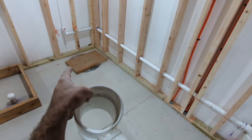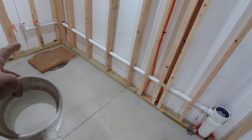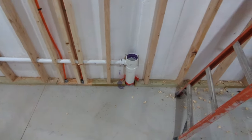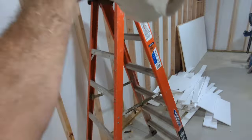This is already at 20 inches from the floor, which is sort of the top end of that height. Any higher and you start to have a really hard time connecting the drain underneath the basins in the sink, and then the sink needs to be lifted, and it just doesn't meet code any higher than about 20 inches off the floor for the rough in plumbing. So it forced our hand, and there wasn't room for the clean out here, so we'll go clean out next, then the sanitary, then we'll get drilled through and connect up.